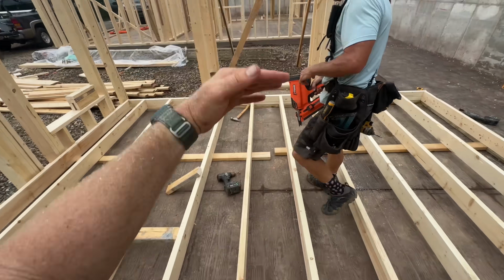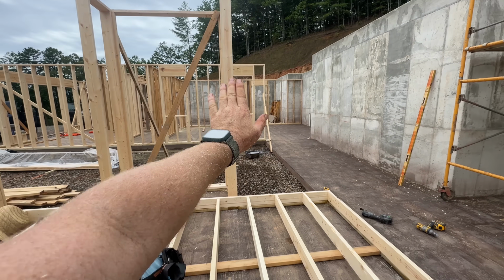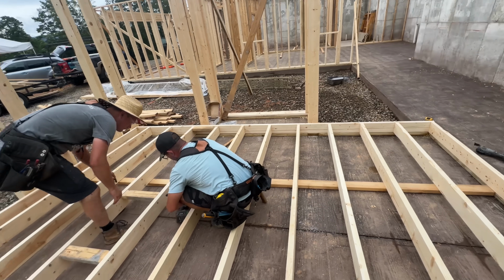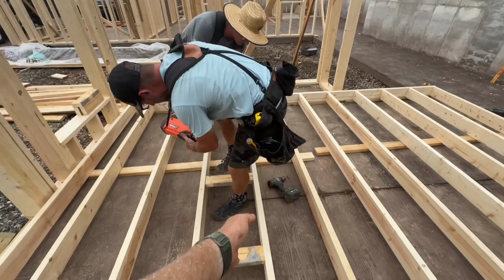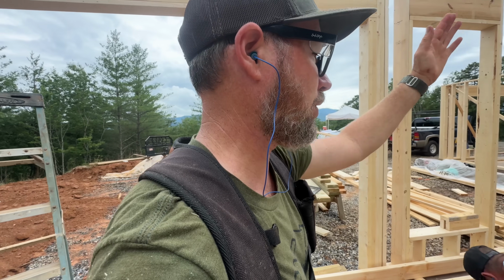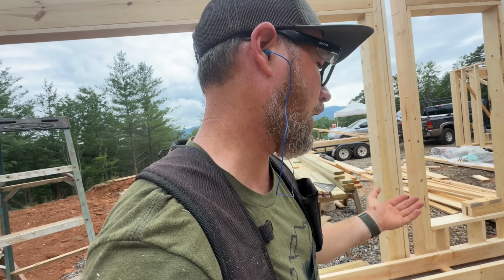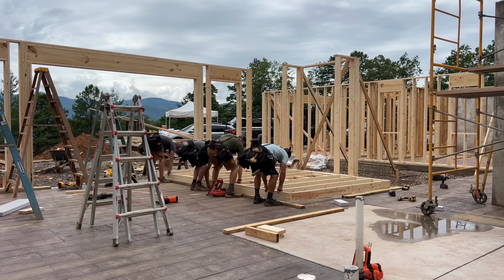It's big enough. This bedroom wall is going to flip up against these fireplace walls, but they fall right between the studs. So these guys are doing a ladder style blocking here to attach that wall to these walls. We may have to block in between those on the outside for a solid nailer for sheathing and siding later, but the inside doesn't need anything. It's not finished inside of that space.